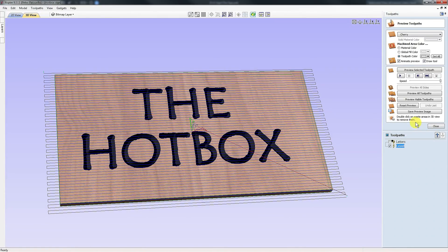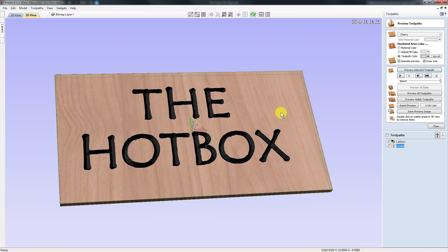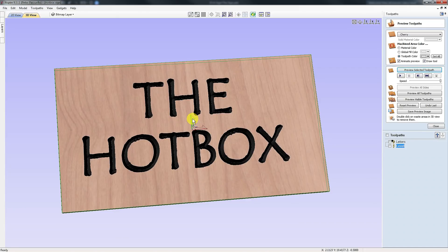Let's have a quick look at what happens when I preview this toolpath. You can see it's cutting down our piece of wood and it doesn't appear to be making any change to the letters. But watch what happens when the cut's finished — the letters got slightly smaller. This is what it would look like if I were to V-carve it normally without a start depth. So I'm going to use this leveling cut to both flatten my material if needed, and to clean up the surface when it's finished. Now for the fun bit — let's see if it works and do some cutting.